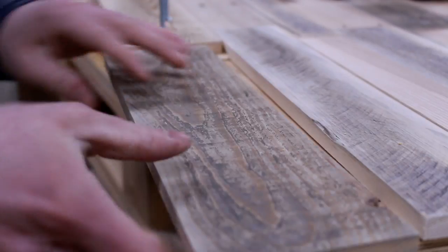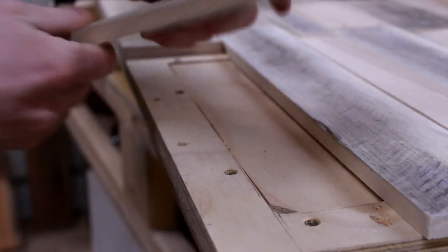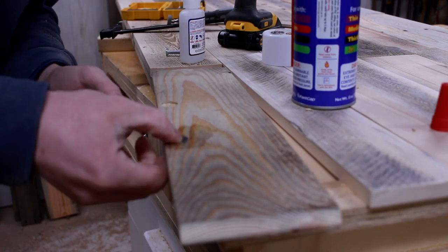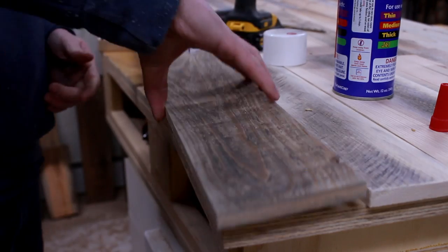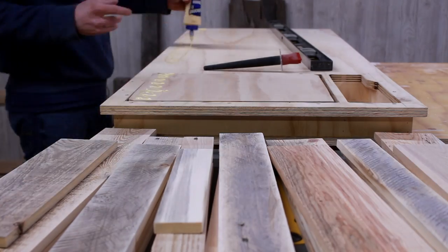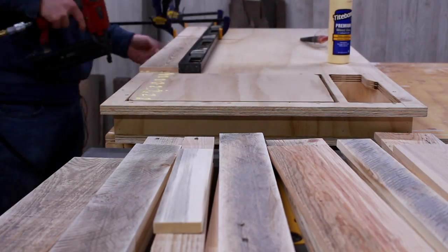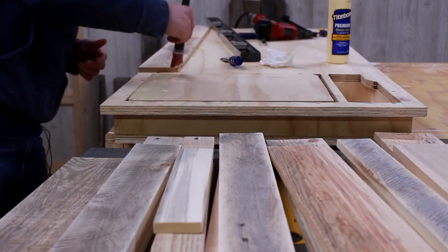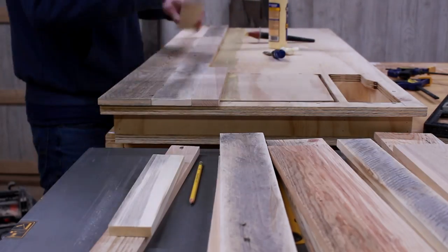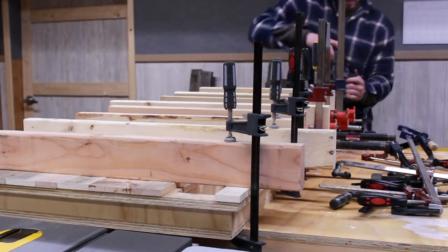I needed a way to open the door, so later in the video I will be adding a simple push latch mechanism — but I thought it would be easier to make the holes for this now. I also secured washers to the underneath part of the door, which is what the latch will be pushing against instead of the bare wood. I placed some scrap wood in the storage area with the same depth so when I close the door the top is flush with the tabletop. For the door I made sure to only glue the top part and not the tabletop around the door. I used a level and clamps to make sure my first row was straight, then glued the rest of the boards. I clamped scrap 2x4 boards along the top and allowed the glue to dry for a full day.